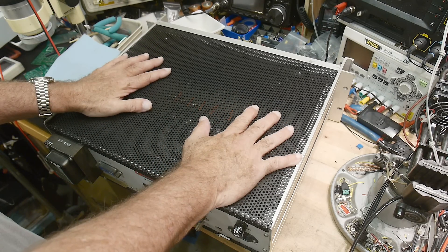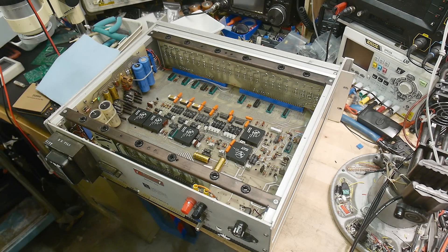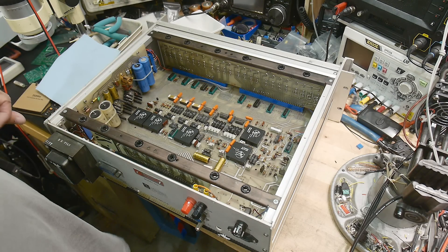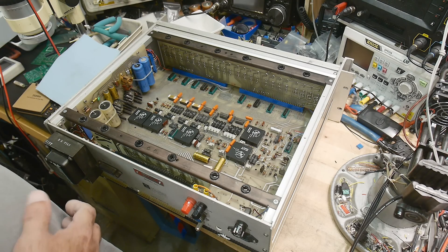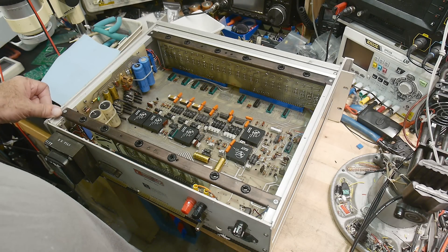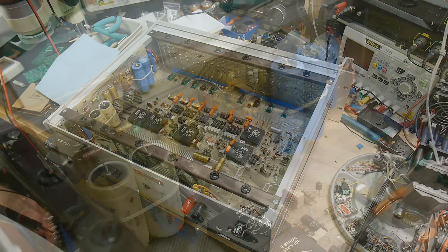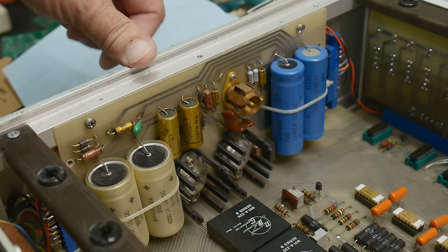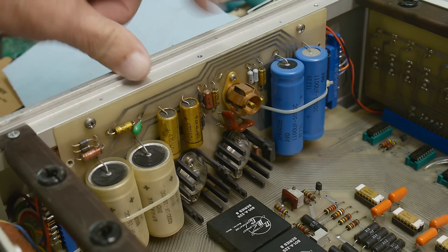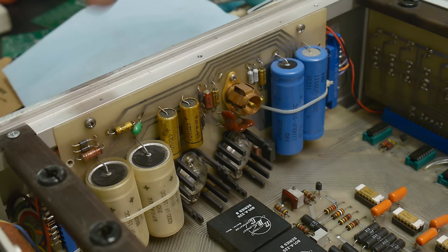Let's take a look at the other unit. This one had me a little nervous — the screws that hold the top are missing, so I can just slide it right off. Something has been done in there. Much to my amazement, it's completely different than the other unit, which surprises me because they basically do the same thing. The power supply is over here and it's much more beefy — big caps and some TO3 regulators, plus a little TO66 with a cute little heat sink. It's on edge connectors, so I can remove it and work on it by itself — really nice.